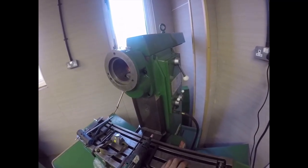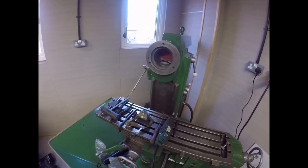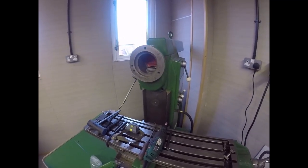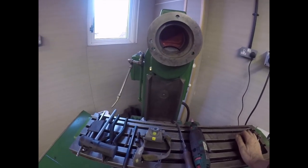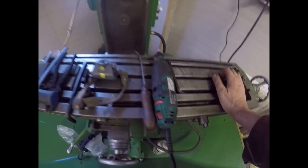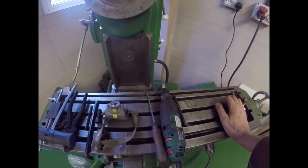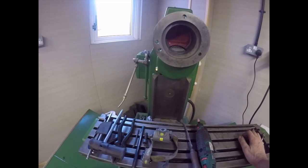I'll show you doing that if I get it done in reasonable time — I've shown you tapping gaskets out before but it's quite a nice sort of job. I had to take quite a lot off that pin. First of all I went into the hole with a little grindstone on the end of the Dremel because I could see it had been damaged — there were two high spots on it. Took those out, cleaned all the paint and crap out, and then tried the peg in, but there was no way it was going in.